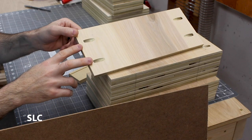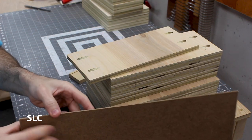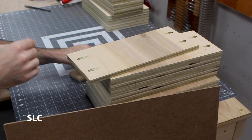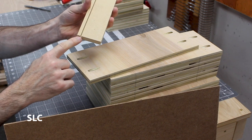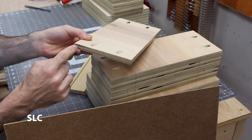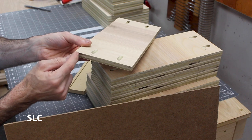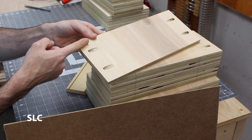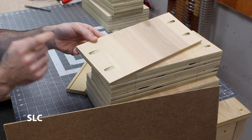Now that we have all the pocket holes in place, I want to cut some grooves in the bottom to insert a piece of hardboard as a slide-in base. To do that I'm going to come up roughly about three-eighths of an inch from the bottom and cut a groove roughly about halfway into each of these boards. That should give plenty of strength on the bottom to hold it and plenty of room for the board to slide in. There's a good chance we'll have to do two cuts to get exactly the width we want.